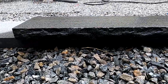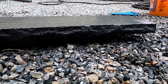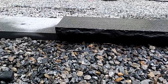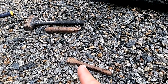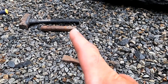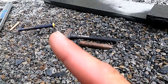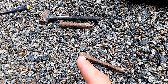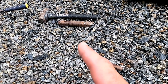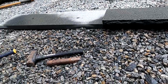Nice rock face. If you can learn how to do that, you can save yourself a lot of money in this industry. But to do that, you have to spend money. That's a $90 chisel. That's a $100 chisel. It's a probably $30 hammer, $20-something dollar hammer. So if you don't spend the money on a nice carbide slanted tip chisel and a pointer like that, you will not be able to do this job. A regular chisel does not have what it takes.